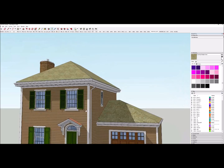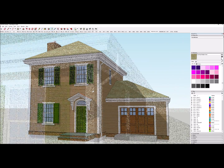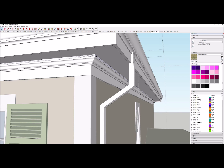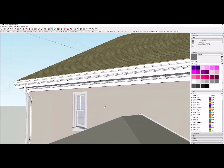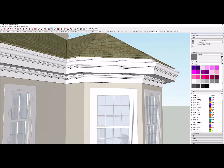Here we are with the new cornice, and I'm going to go in, and there's a little strip there 3/4 inches deep, which is ventilation. I'm going to paint that gray to show that it's different material. The wall that I'm doing, the finished wall, is ventilated in the back. It's what they call a rain screen, and I'll do a video all about rain screen walls. But it needs to have an airflow behind the siding as well as in front, of course.